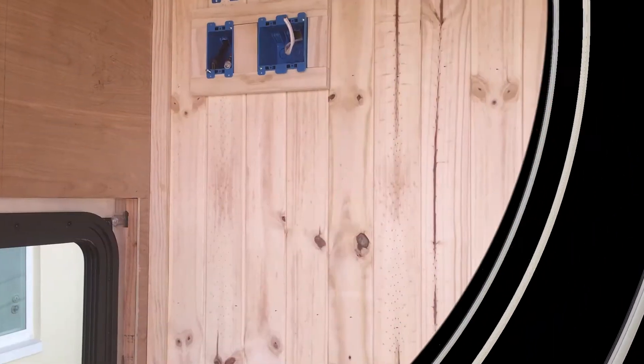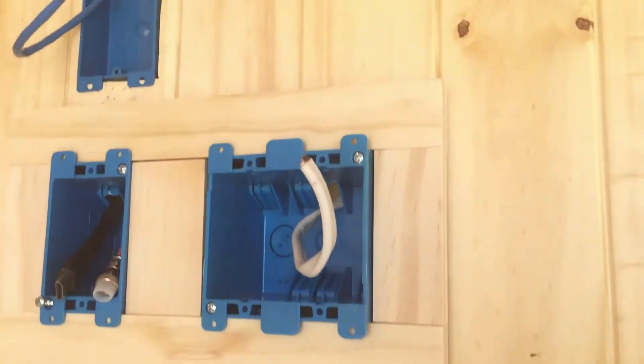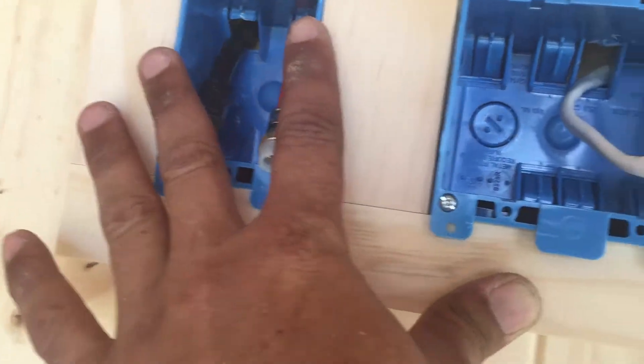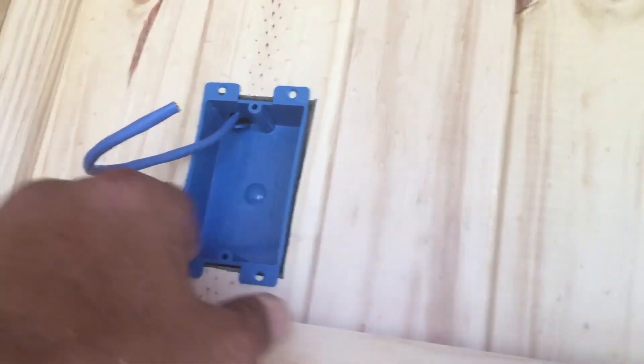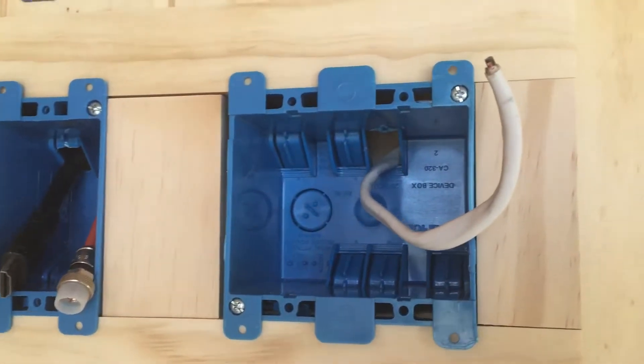This wall next to the refrigerator is fairly shallow and I wanted to use a full-size box because the backs of those devices are pretty deep. So once I got my wall tongue and groove down — which looks really sweet, actually — I put my boxes in the hole and then built a box around it, so now I've got the full depth. The cat six was a very shallow box so it was fine, I didn't need to do anything with that. Let me get this glued up, screwed, and secured and I'll be back.